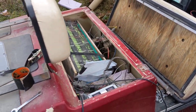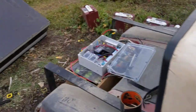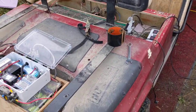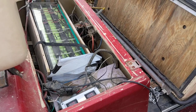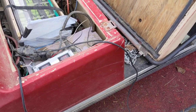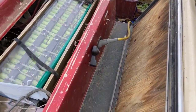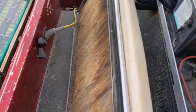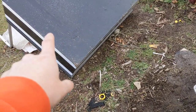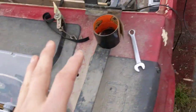This golf cart is kind of solar powered in the summertime. The solar panel is off right now — it's just the frame. It's an older panel meant for going on roofs, but it's been working great. It actually increases the range of this cart in the summertime by a good 25%, which is like adding 25% more battery. But the aluminum frame to hold up the roof wasn't strong enough to hold that weight and all the vibration and shaking from off-road driving, and eventually cracked. So the timing worked out for me because I had to get the thing off to access this area — normally that bucket sits on here and you can't access any of this. So that was another opportunity I wanted to use to make this video.